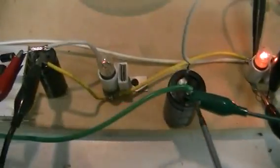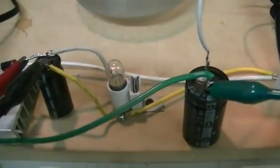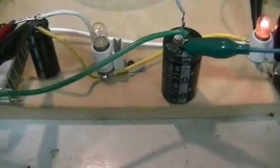We're coming out of the battery and bridged across this cap. So we go into the cap on the negative side, out of the cap and across to the emitter. Our cap is a 6800 µF 25 volt cap — quite a large beefy cap with large terminals for high current outputs.